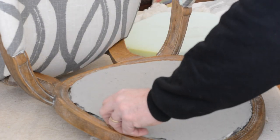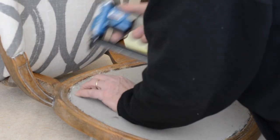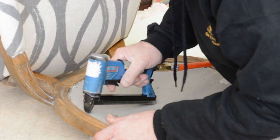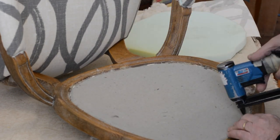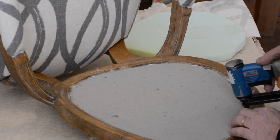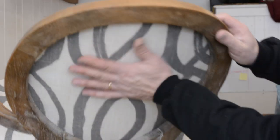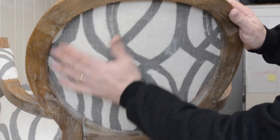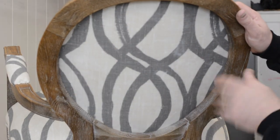This is like a buffer between the fabric and the cardboard. Place the cardboard in there and staple it — don't need too many staples. The inside back fabric is going to hold that up nicely, but grab a couple more staples by the top because you have some force down when people sit in it. Now I'm going to check to make sure the staples didn't come through. I'm going to feel around to make sure there's no loose staple. Be careful — always check like that.